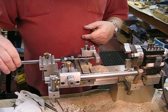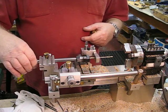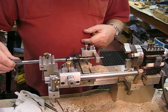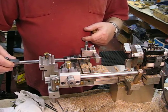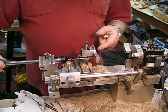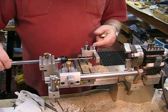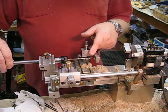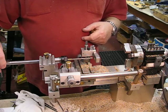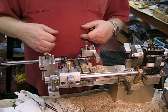I don't have any fixture for pushing or pulling it. I found that by hand pressure, with the brass it cuts really nicely and doesn't take a lot of pressure. Of course, when drilling brass I always put a negative rake on the drill bit right on the tip on the cutting lands.